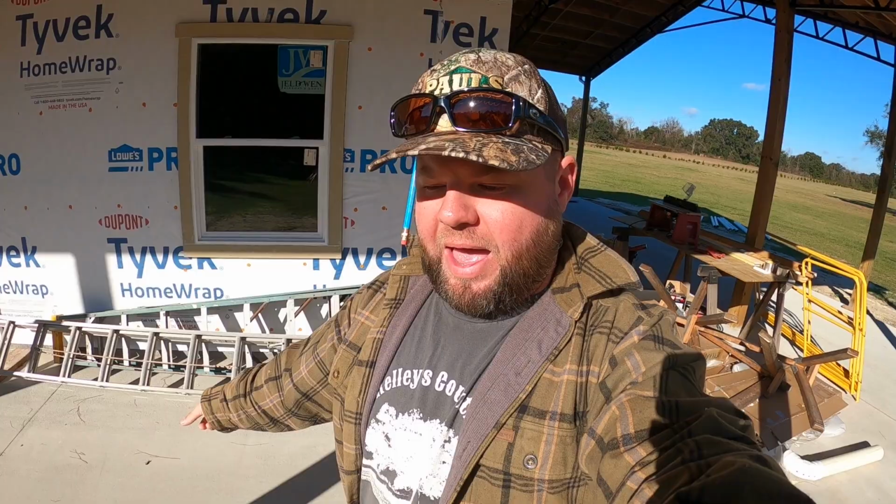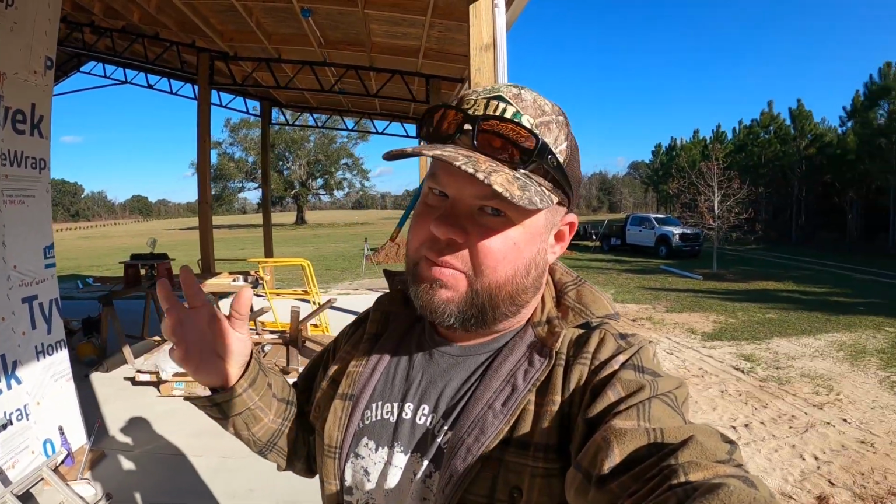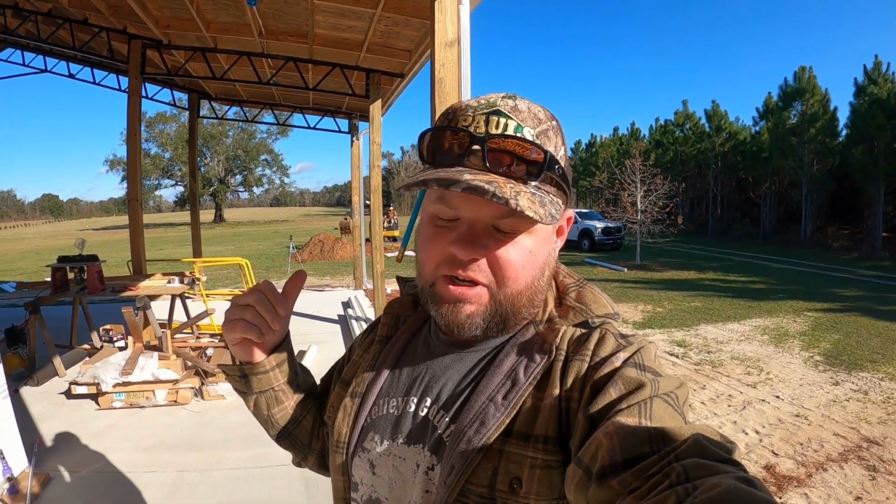So what is very fortunate about that area out there in the yard, that sand, that's the only spot on the property that I have that kind of black looking sandy soil like that, and it drains really well. Actually, what the house is on right here starts turning into a clay sand mixture. It packs really hard and doesn't drain nearly as well, so it's the perfect spot for the septic tank.